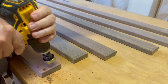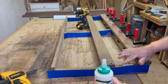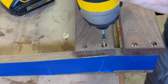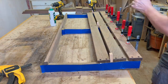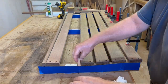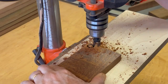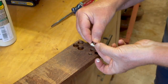At this point I've done some sanding and I've put an eighth inch radius on all the seat stretchers, and now I'm just pre-drilling the countersink holes. Using the stainless steel deck screws and some glue, it's just a matter of screwing each one in with a consistent spacing. So that's a lot of countersunk screw holes to fill with some plugs. I'm using this tapered plug cutter and it takes a few tries to get the depth of cut just right so it fits snug but doesn't bottom out on the screw head.